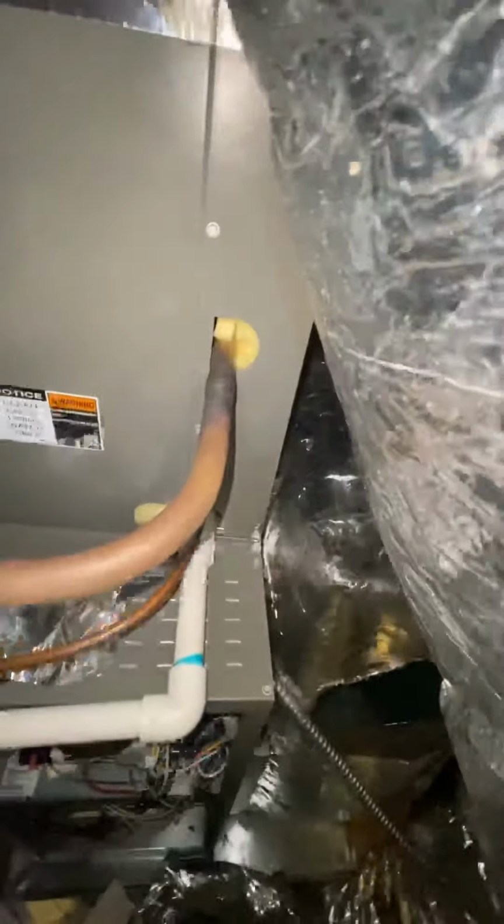All right, y'all. We just brazed this guy in. So we brazed in. I'm gonna let him know he can pressure test. Got all my supplies connected. I'm gonna tape this up right here so you can't see that insulation peeking out. I had to poke the hole through so they could access the manual damper. But just gotta get my line set on, my returns here. Just gotta get the collars put on, screwed to the plenum. Put those 3 ducts on.